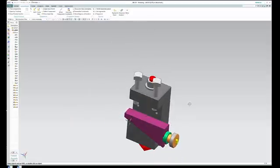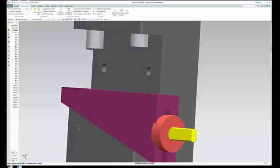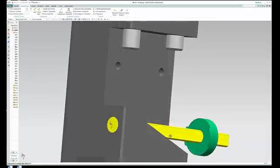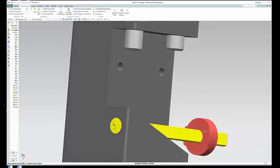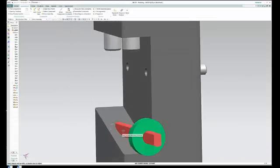Of course, all the bolts and such are centered on the tool post body. And then also note that, let's see if we can hide this here real quick. This piece, there's a flat in there, and let's hide this one. There's a flat right there that those two flats have to line up with the wedge, and then this piece, the flats on it should be parallel to the faces on the tool post body. So that should all line up and be centered.